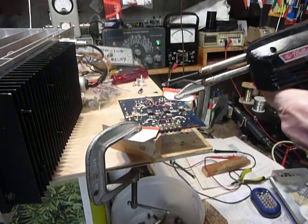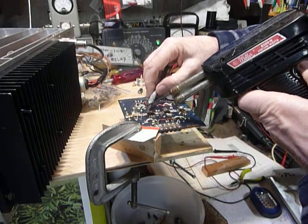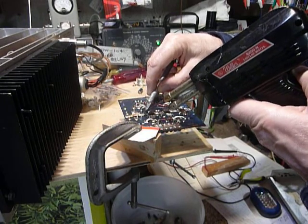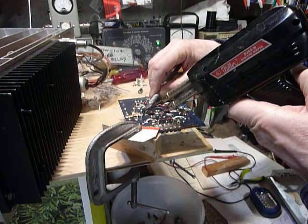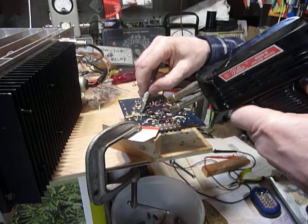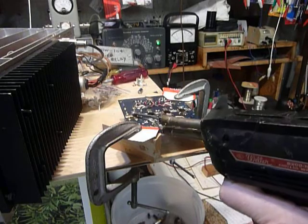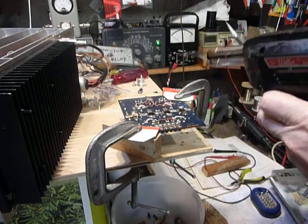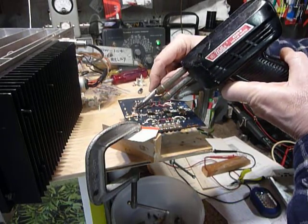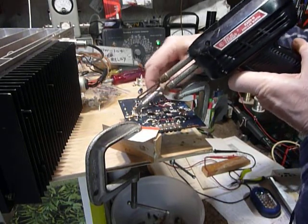Hold the gun with my left hand, and you want to start on one side of the transistor and heat it right on the tab. You can get this exacto knife to go under the tab and fold it up like that. Now we want to get it folded up all the way like so, and then come around and get another tab. By the way, when I put these back in I always put a little bend in the end of the tab that points up a little bit to make it easier.